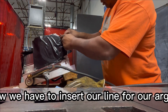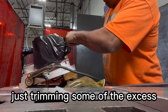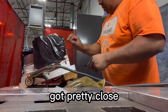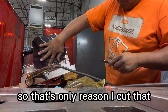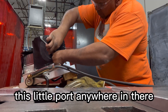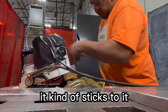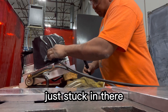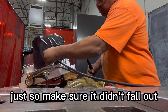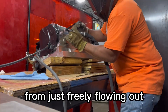Now we have to insert our line for the argon. I'm just trimming some of the excess tape — that's where I'll be welding on that side, so that's the only reason to cut that. Then we'll create a port for the argon line, just a little port anywhere in there. Since it's tape, it kind of sticks to it. I put another piece to help hold it on and make sure it didn't fall out or let argon flow out.